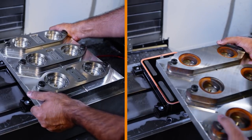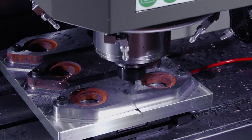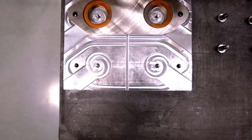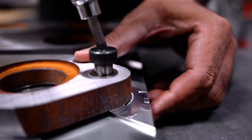As usual, keep in mind that we have two identical sets of these pallets so that while one set is being machined, we are changing parts on the second set outside of the machine. Holding multiple parts per pallet reduces overall cycle time by minimizing tool changes, and twin pallets keeps idle spindle time down to about 20 seconds.